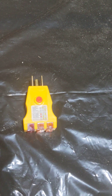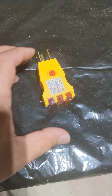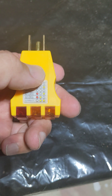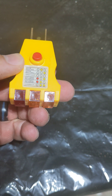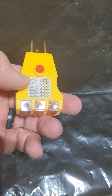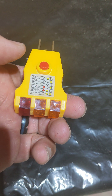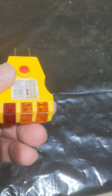If you have an outlet and you're curious whether it's protected under a GFCI, you can purchase one of these testers at Home Depot. They usually come with a little button. You plug it in — it'll light up if you have power to the outlet. With it plugged in and the lights illuminated, you just hit the button. If the lights go out, that means that circuit is protected under a GFCI located in another location.